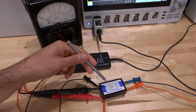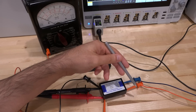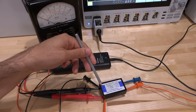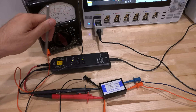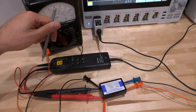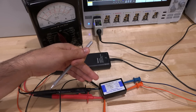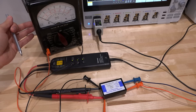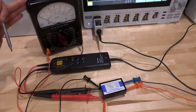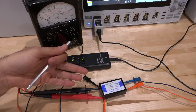Here's our setup to test the high-voltage module. I've removed it from the board so it doesn't interfere with everything else and can be run standalone. It's a DC multiplier with active circuitry inside — DC voltage in, up to 1.7 kV DC out. I've connected it to a Tektronix THDP0100 active probe, which goes into our Tektronix 4 Series oscilloscope to measure the waveform and verify stability and voltage. At the same time it's connected to an analog meter — the Model 630 — which has its own 6 kV breakdown rating at its input.